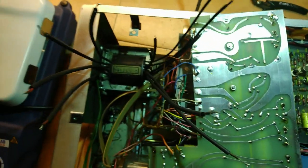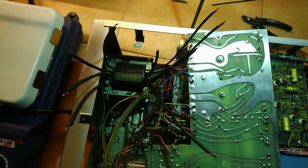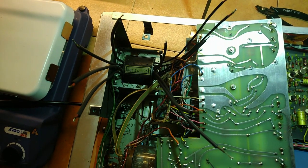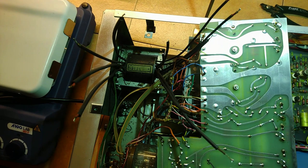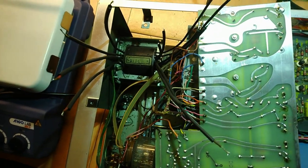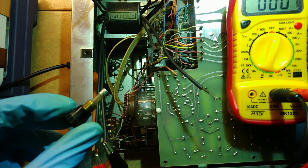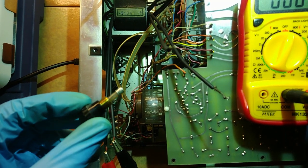And then I tried to connect it to the power with all of the secondaries cut off to see if it would trip the breaker. It did not trip the breaker, but I heard a loud pop. And it was coming from the transformer. So I think this is beyond repairable. Well, more news. Apparently the pop didn't come from the transformer, it came from the fuse. The primary side fuse, half an amp, blown.